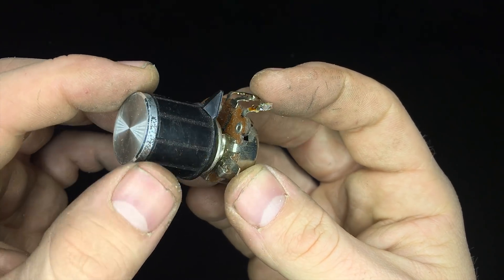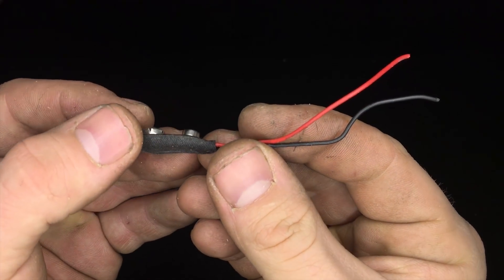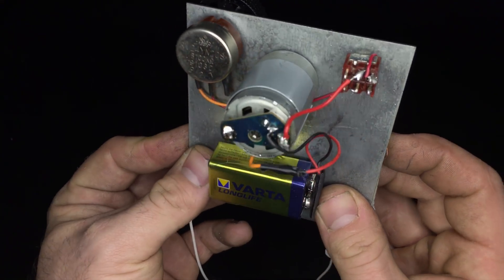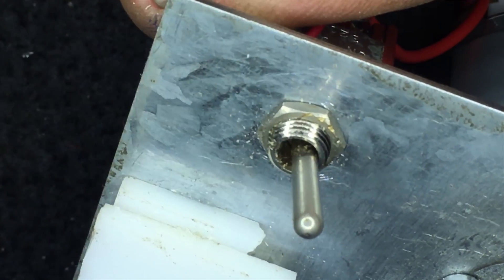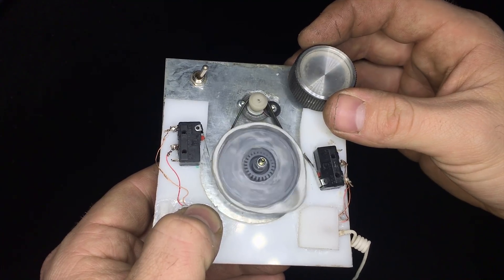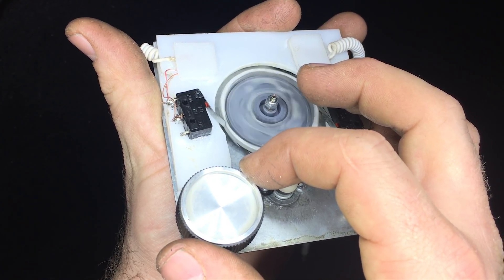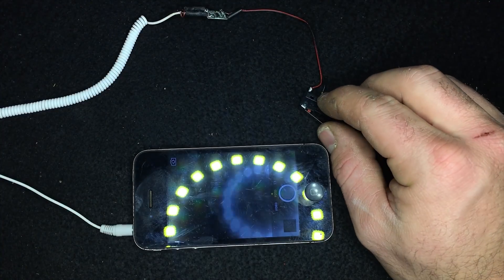I need to make the power system for the motor. A little general switch goes here, the potentiometer goes here on the back, and we also need a battery connector and a nine-volt battery. After connecting all the cables, we have the main switch to give power to the whole system, and with the potentiometer we control the speed of the motor — so also the FPS, meaning how many pictures are taken every second.